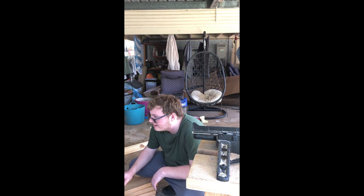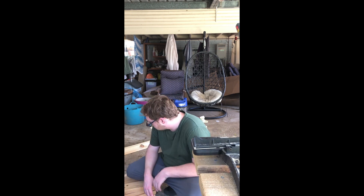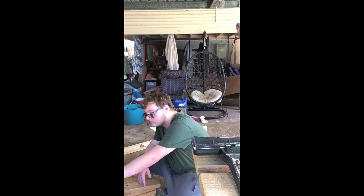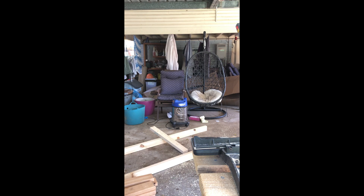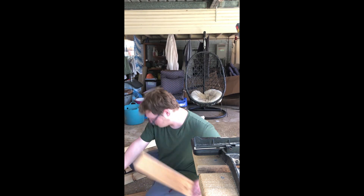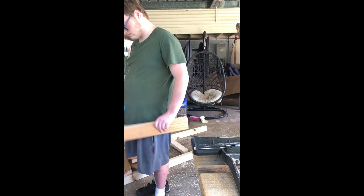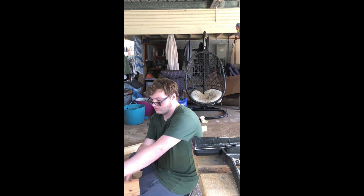The last bit is to put the plywood on top — I screwed mine in, but I don't believe it's needed. I finished mine with outdoor furniture oil stain that's mould and UV resistant, which is necessary if it's outside under cover and hit by the sun. But other than that, it's easy enough to give it a prime and paint, or stain, or just give it a skirt.